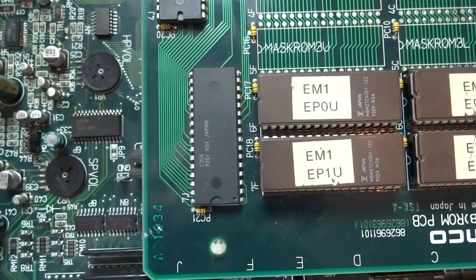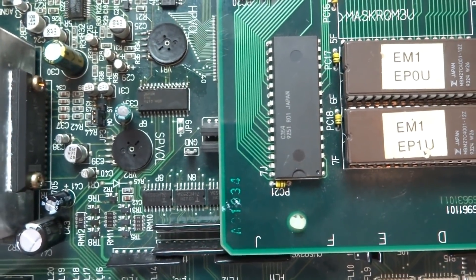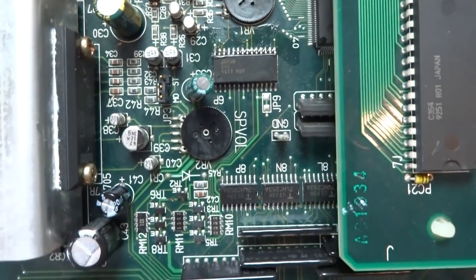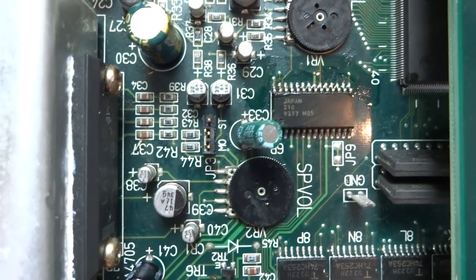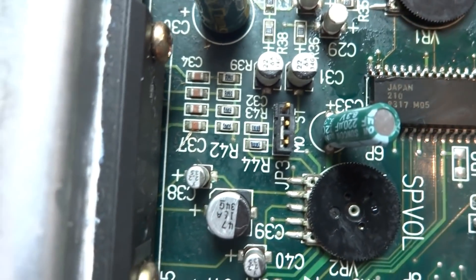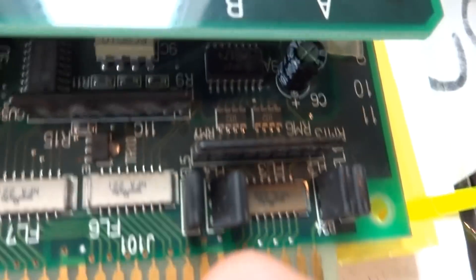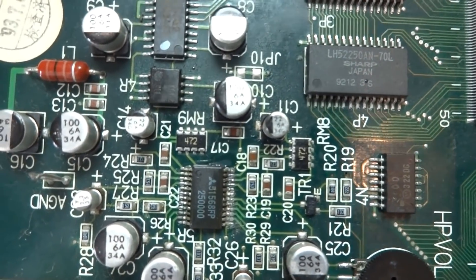This one is Emeraldia — like 'emerald' and 'dia' — so Emeraldia. This board is the Namco NA2 hardware, and there are a few games released on it, though not too many — mostly puzzle games and maybe one fighting game. This is the only NA2 board I have. I did realize there is a lot of leakage around here, especially at this jumper — the pins were completely corroded, green, and it took some effort to get that off and back on again.